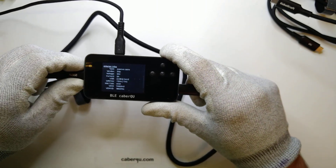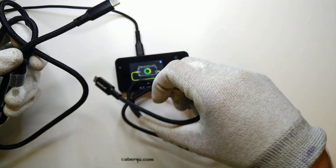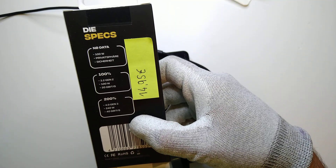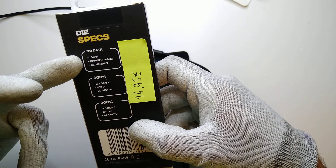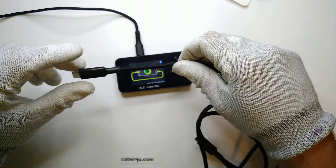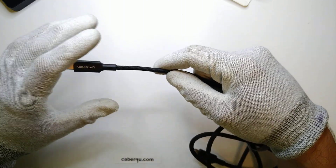So now we know what these two cables can do — but why would you buy a cable that can do 240 watts and USB 4 at 40 gigabits, and why would you buy a cable that cannot do data at all? On first glance, a cable with no data seems pointless. But if you look at the packaging, instead of USB versions and data rates it just says 'privacy and security' and the charging rate — they don't have any specs to put there besides buzzwords. And those buzzwords are there for a reason: you buy this cable when you want to charge your device in a public spot where you don't want any data transmitted. For example, if you hop on the bus and want to charge your phone from a USB-C connector on the bus.